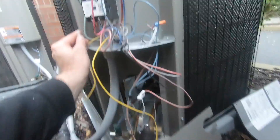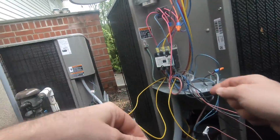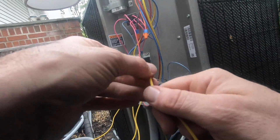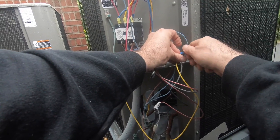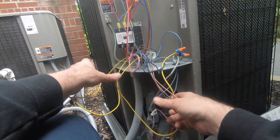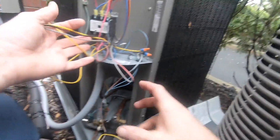It's got to go in to the back with the contact there. So now you have that side connected. It has to go through that switch before it comes up. This is the crankcase heater — this is line voltage. That's how you replace it. Then just strap all the wires back up.